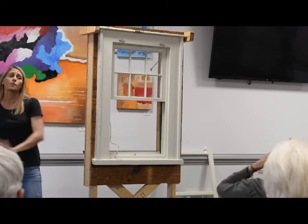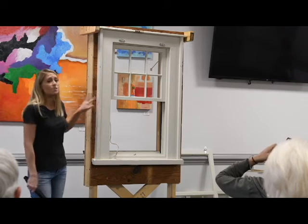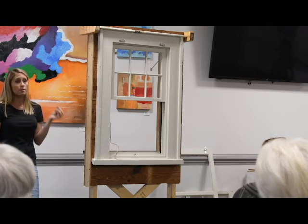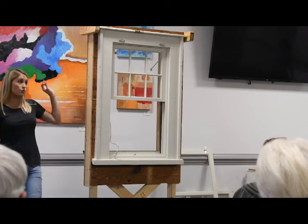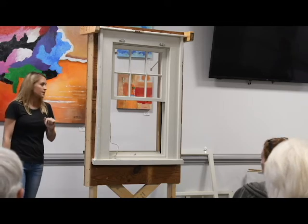But you bring up a good point about paint: in these old windows, you definitely want to keep them painted. That is how they keep the water out. Lots of times you want to treat them with a boiled linseed oil first. Then you use an oil-based paint on a primer. You can use latex after that if you want to, two coats of latex paint.